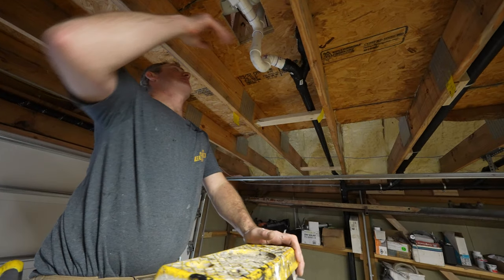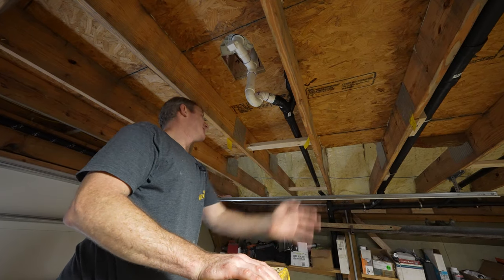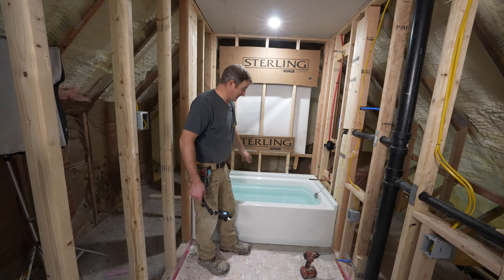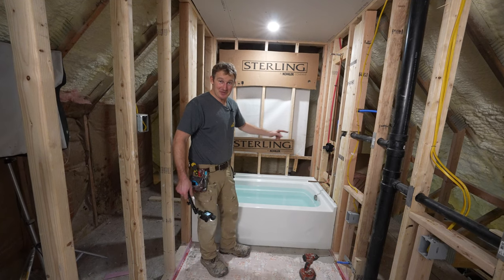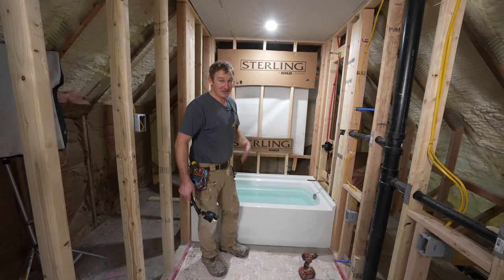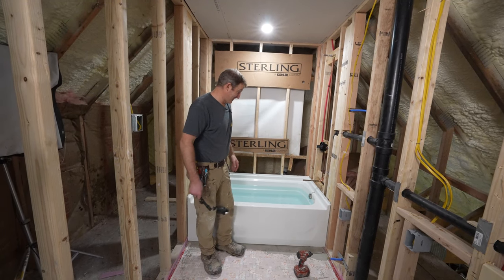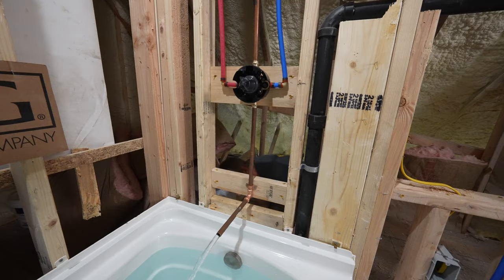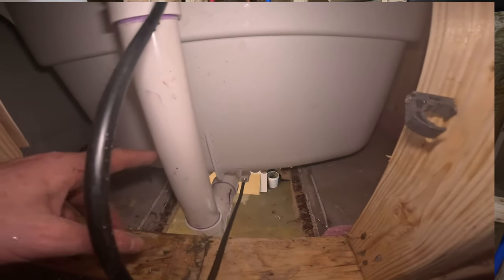Just check your plumbing when it's running. I'm going to fill up the tub and make sure the overflow is fine. You want to make sure you check it before you go filling the entire tub up and make sure nothing's leaking. Everything's good, everything's flowing just fine. It's super important to fill up your tub and fully test it — make sure there isn't any leaks because the overflow is just as important as the main drain. I've definitely gotten caught in the past where there was a small leak from the overflow, and it took months until the client found out. By then there was already drywall damage and mold I had to repair. So definitely check it out at this point. Fill this up, let the overflow completely fill up, and test it.